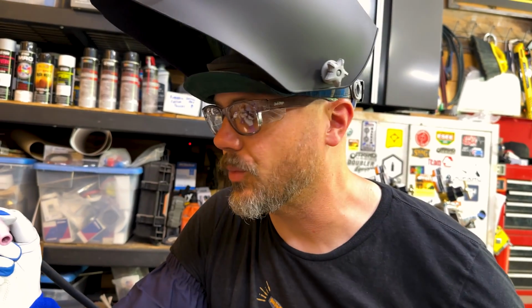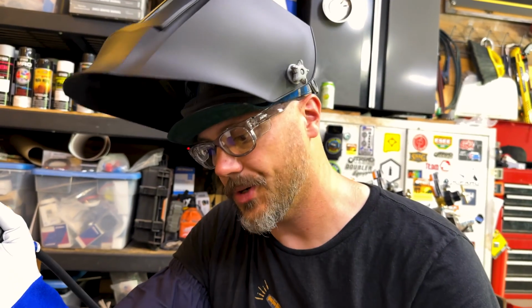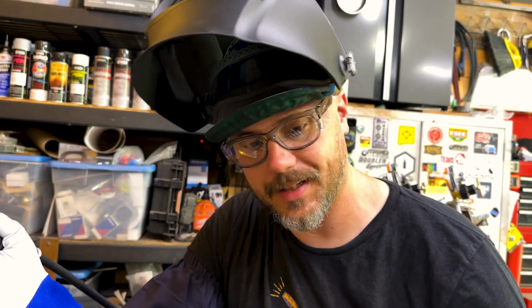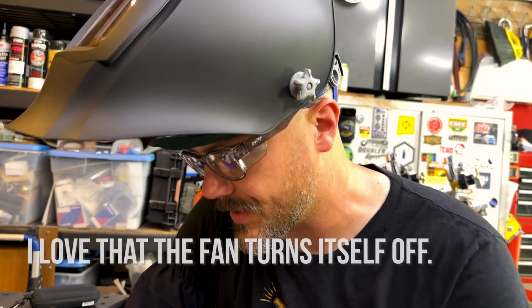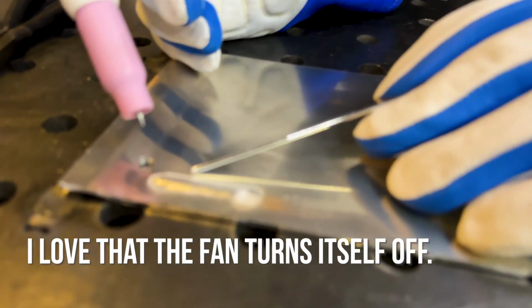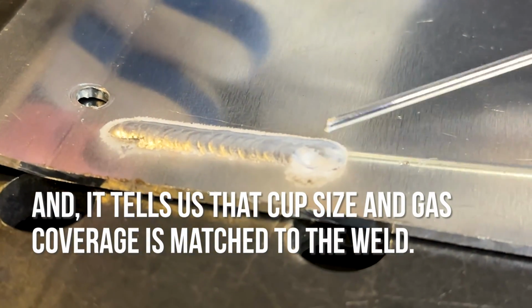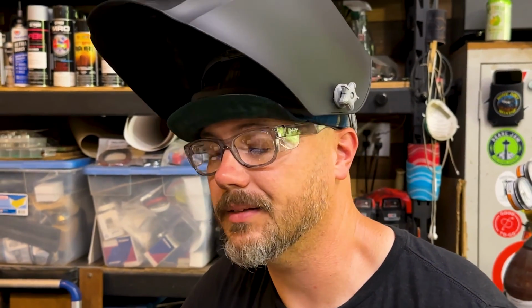What mode is that set on, David? So that's TIG aluminum, right? So we are on 16 gauge, which is .063. That one's pretty nice. And I didn't clean any of this, right? But look at this. You've got good cleaning action just right outside the weld. That tells you that your balance is about right. Honestly, absolute truth, I've not welded in about a month. Right before going on the big BDR trip, I haven't welded since coming back, and that's been at least 3 weeks.